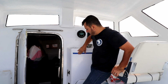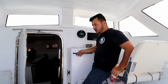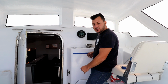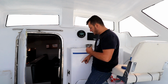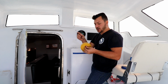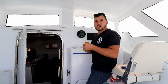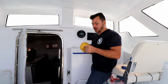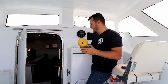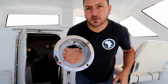We're going to tape everything up so that we don't scratch the paint like I did over here. Tape it up with some of this blue painter's tape, and then check how high we want it and the clearances. I'll probably use the hole saw just to make a mark, and then take the jigsaw and cut it out if this doesn't cut too well. These wood hole saws are fine, but they don't do well through fiberglass, they blunt really quickly. But I'm going to use this to create a really nice line, and then I'll do the final cut with the jigsaw. What I've got to mount first is this adapter bracket.